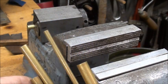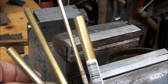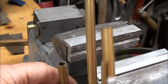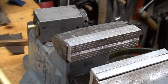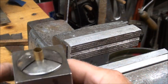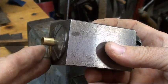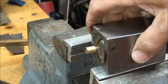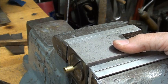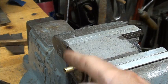In my model making I use a lot of hobby brass tubing, also available in copper, aluminum, and sometimes even plastic. If you try to hold this in a regular bench vise, usually you crush it or you take it out of round. So one of the ways I like to hold it is to put it in a 5C collet in the square block. Or you can hold it in a 5C collet on the lathe, or a 3C for that matter, or even a 3-jaw chuck. This is a good way of holding that tubing without damaging it while you saw it and file it.